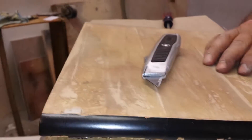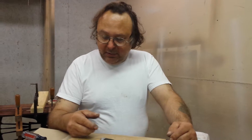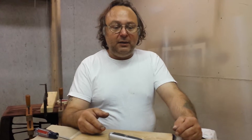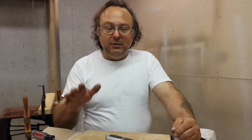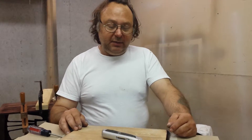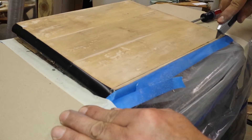Rather than putting veneer back on the top, originally I wanted to take this whole top piece off, but it was really a pretty tricky chore to do. This radio was really a basket case when it came to me, and I was actually afraid to rip it apart. But now the radio's completed and it looks really nice. This will never be stable though, and this man really enjoys this radio — it was a beautiful piece. So I want to make sure it's done right this time. I'm going through the hassle of ripping this top off very carefully, because it meets up along the front face plate here too. Basically what I do is come over here and just cut along in there a few times with my X-Acto knife.